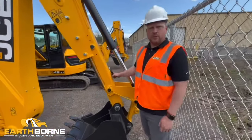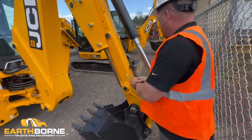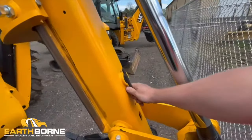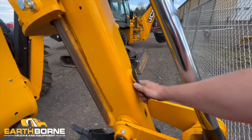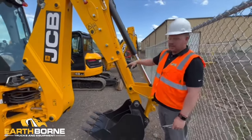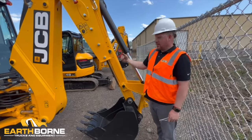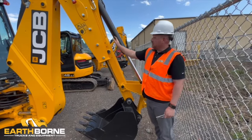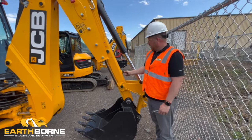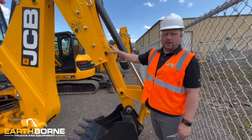We have another lock back here. This one is for your extending dipper. You have a linchpin here that you would pull out. Once you have it at the right position, this pushes into there, and this will lock that extending dipper up in the arm. Over time if you let this machine sit, the boom will drift, so you want to be careful and always lock this up when letting it sit or put the bucket on the ground. This pin here will lock that extending dipper up into the boom.